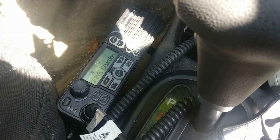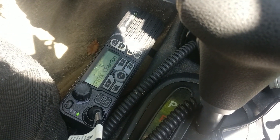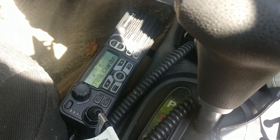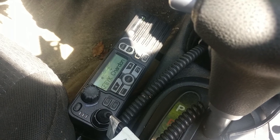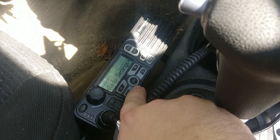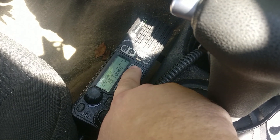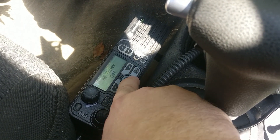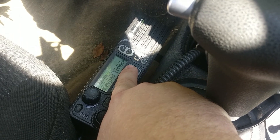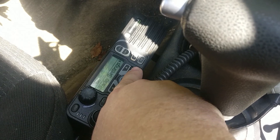More recently I've become interested in the 33 centimeter amateur radio band, which is 902 to 928 megahertz. To accomplish this, I'm using a modified Motorola XPR 4580 mobile radio. This particular one is capable of digital operation — assuming I purchase an entitlement, this will do DMR. Currently it's only programmed for out-of-band operation in the amateur radio band under analog operation. However, I am working on putting up a local 900 megahertz repeater, and with the use of an MMDVM board we can accomplish digital DMR operations, so that entitlement may certainly be in the future.